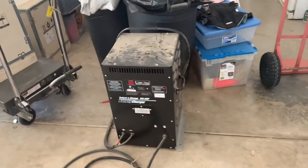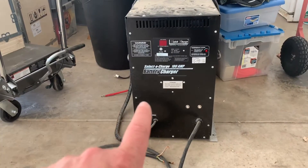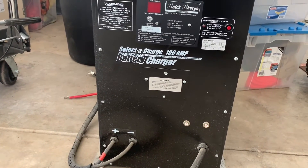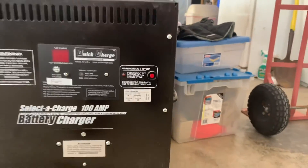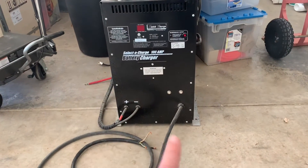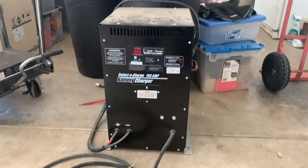This was the battery charger we had in there at one point. The Radian wasn't quite enough for charging that many amp hours of storage, so we did add this Select a Charge 100-amp charger. The model number is SCX 48-100. This unit helped out quite a bit. The other benefit to running a charger like this is if you just want to charge your batteries and don't want to do the pass-through, this will give you a super clean, filtered charge so the generator is not passing through the house and it cleans up the power factor a lot.